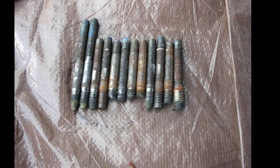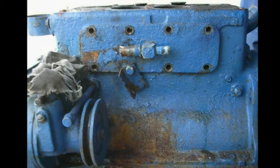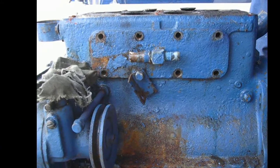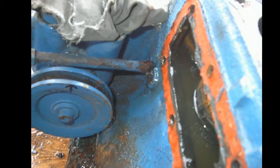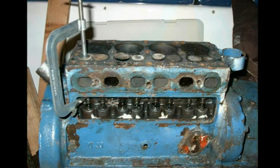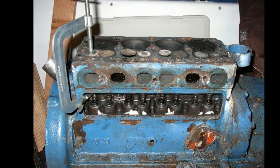Those are the studs that were rotted away — those all get replaced, of course. On the other side of the engine is where the cooling water goes into the four-cylinder jackets. That had been cleaned out before, so it's been accessed. Cleaning those jackets helped a little bit, but not much. 30 years of gunk, saltwater cooled — it adds up.